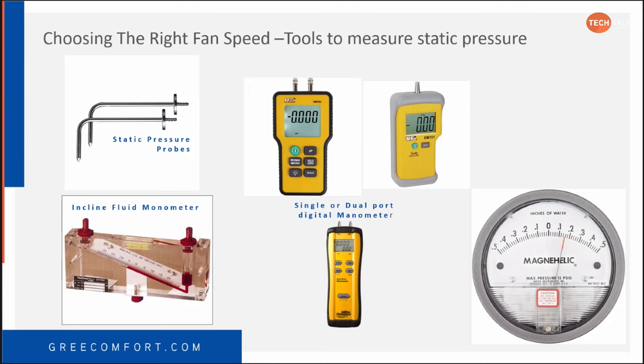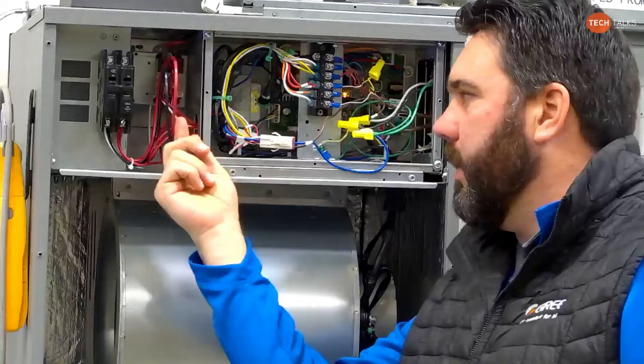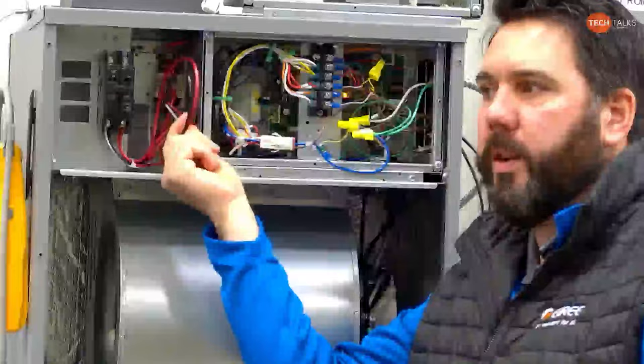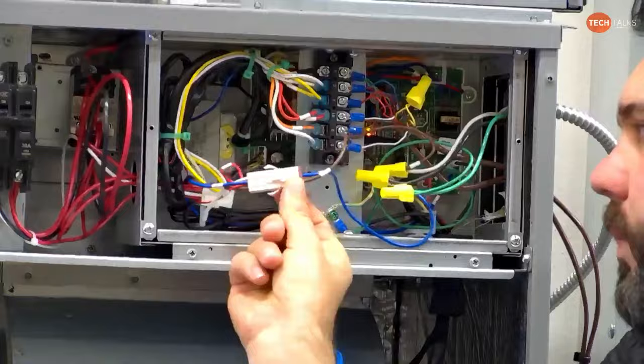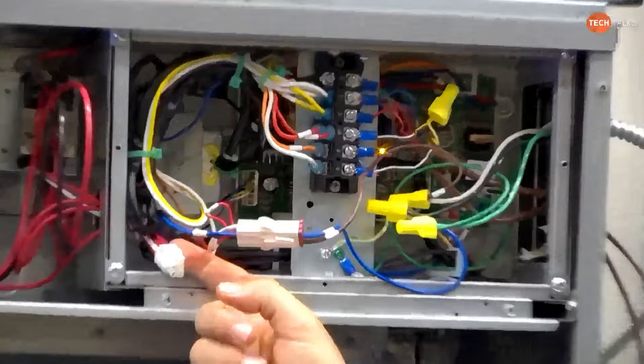So this is the Molex plug. It's normally sitting right here, so you can plug your heater kit in. But you can see we have the pigtail attached to the incoming power wire. There is no L1, L2 on the terminal block. And you can just unplug this and plug the heat kit into it if you're going to provide power in that direction or have a heat kit.